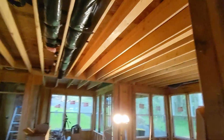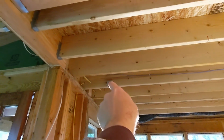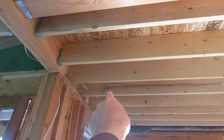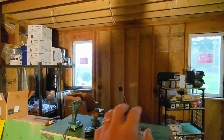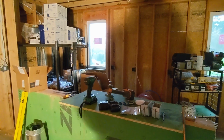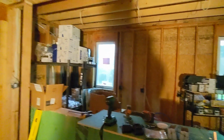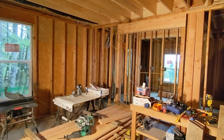Carbon monoxide needs to be one on every floor, so this one's going to be a dual purpose. Out here, it does say in the code that you can also, you don't have to, but you can, and we decided to do so, put one out in your living areas. So there's one right there, and that's the first one in the sequence. We have a fireplace, needs to stay away from the fireplace. We have a kitchen. All of the cooking stuff is on that side, and this is like washing and sink. So again, stay away from your range and everything else in there, or it will create a nuisance trip. This is kind of nicely located to be near the dining, but away from it, near the kitchen, away from it, and at the very edge of the living room, away from the fireplace.